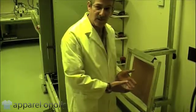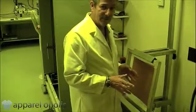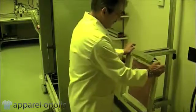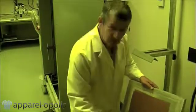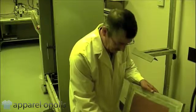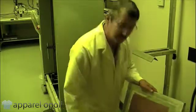That's basically how you coat a screen, and this is how we recommend you do it. I know if you don't have one of these machines, chances are you're going to use one hand — you'll hold the screen with one hand, hold the scoop coater with the other, and coat like that. That's fine for one or two screens, but remember to do it the right way as much as possible. It really does make a difference.